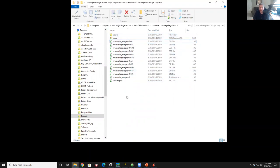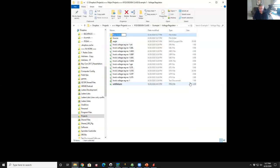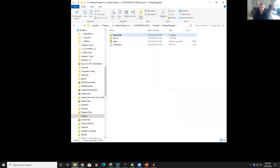Okay, and the rest of these files, these are your Gerbers. So these are the files that we need to send to the fab. So for these, I'll create another folder. Again, you don't have to, but I do it. And I say sent to fab. And I take these files here and I copy them into my sent to fab. So that means I would do this for every version that I have of a board.